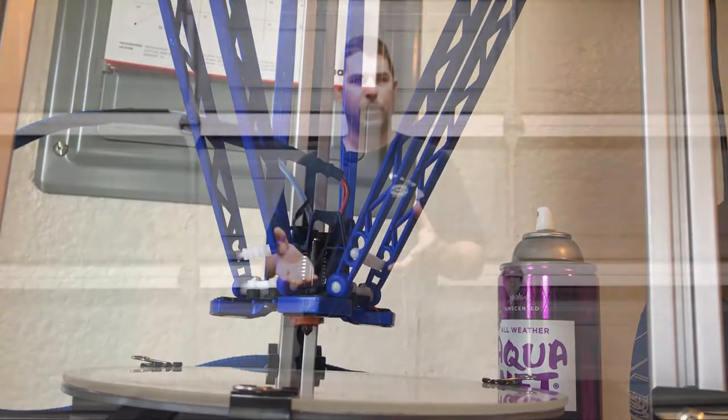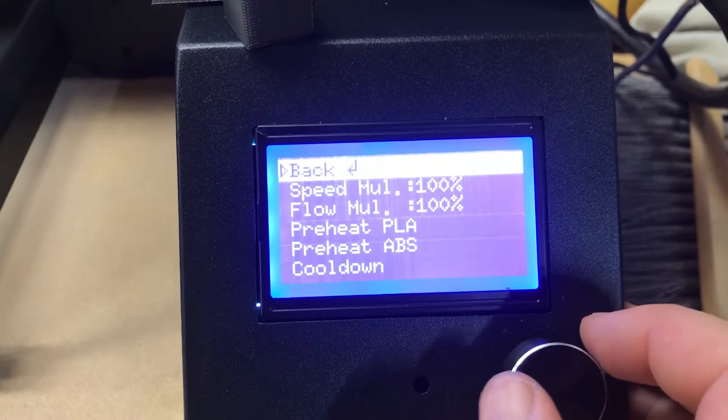However, other printers that have a free-floating heater, such as a Prusa i3 style — either the clones or the Mark II or many of the others — you will find that just like the plastic flowing through them that changes properties as it gets hot, your bed is also going to tend to warp and bow, and your hot end itself will expand and contract as it gets hot. So it makes sense that you want to factor that into your bed leveling.